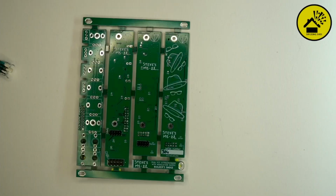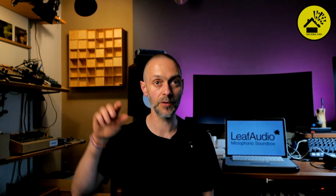What do we have on the next step? Yeah, the next is we have to unpanel the PCBs. Some mechanical stuff. You need the wire cutter now. If you don't have a wire cutter, I would use flat pliers and break these small areas around, like the frame, with the small pliers. But if you have a wire cutter, I would use this, like Andy will do now.